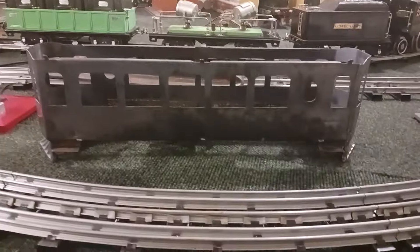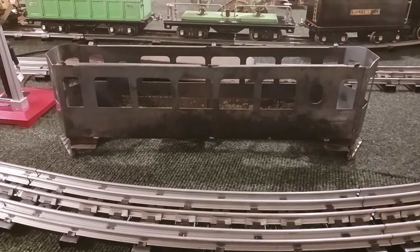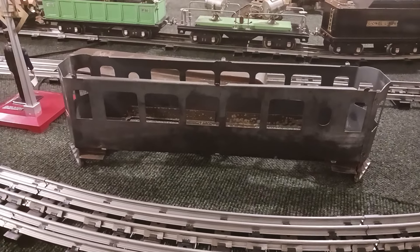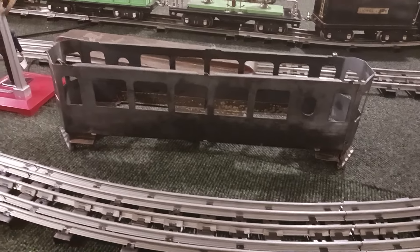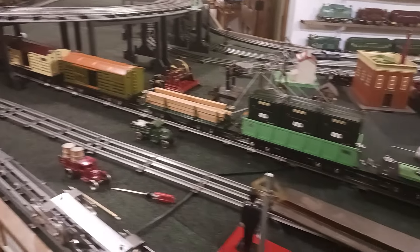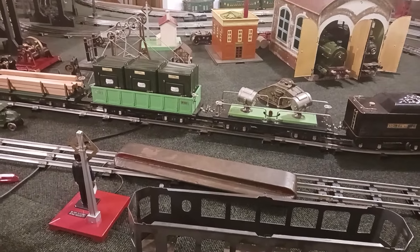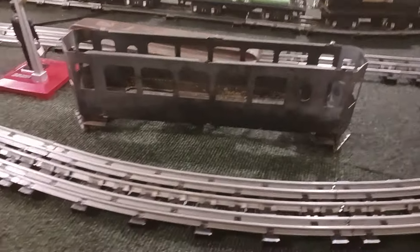I finally took it and gave it a bath in hot water and powdered Tide, and that takes the paint off of these older train cars and toys lickety-split. It would be easy to take every one of those Lionel standard gauge cars and dip them in a hot bath of boiling water and Tide, and there would be no paint left on it. Does a very good job.